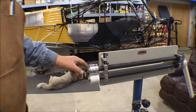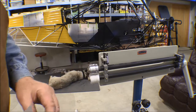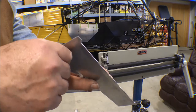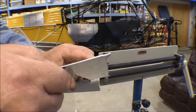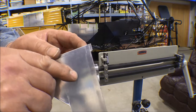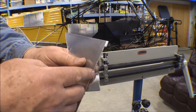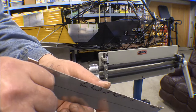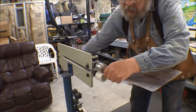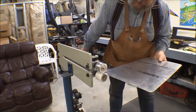I took some measurements and it's exactly an inch from here to the center of this bead. I just ran a piece of 40-thousandths — this is a cutoff piece — measured in an inch and ran that through there. It makes just a little bit of a flange there. Where it's cut out, this is what I practiced the cutout for — that pattern for the hinge to cut out and fit around the hinge. It went ahead and bent over a little bit, but you get to the part that wasn't cut out and it makes a nice little flange on there. I'll try to keep that line right on the outside edge of that roller.